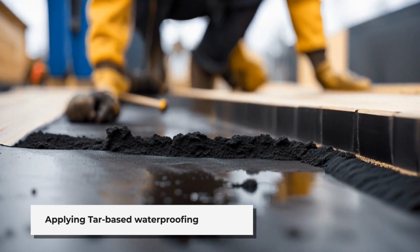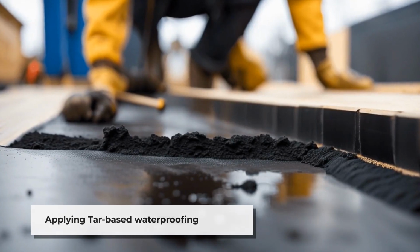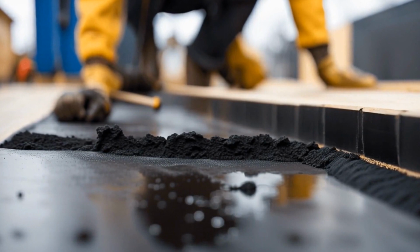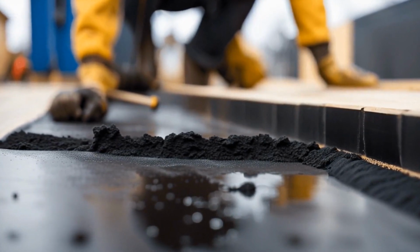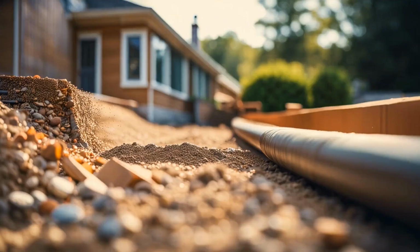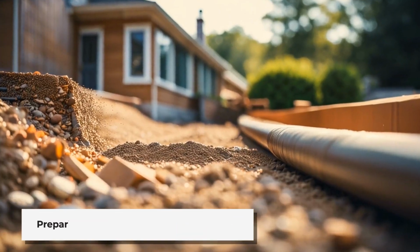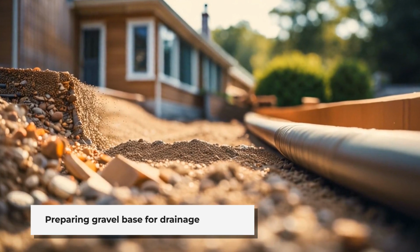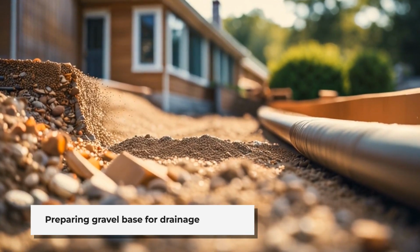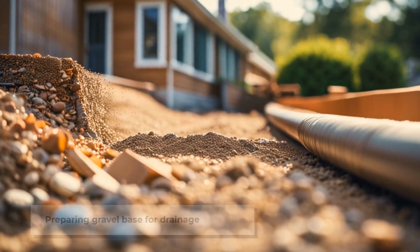Add a thick, heavy-duty membrane, 6 mil or above. Roll out a thick, heavy-duty plastic or rubber membrane and lay it up on the wall, with some help, on the pitch over the footer, and apron it outwards away from the wall. Add a few inches of 3/4 inch gravel base for the drainage pipe to lay on in the trench below the footer. A base of gravel in the trench is needed to support the plastic perforated drain pipe.